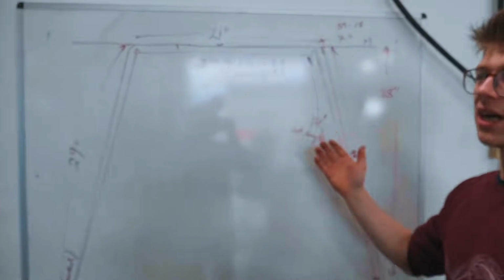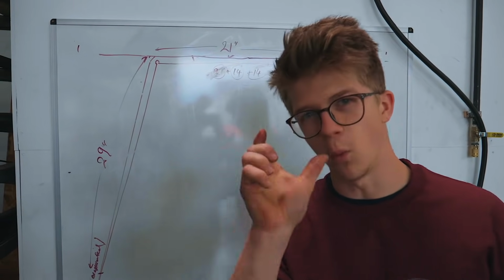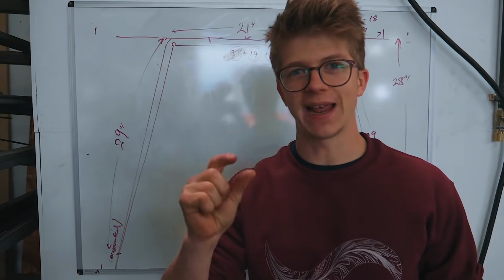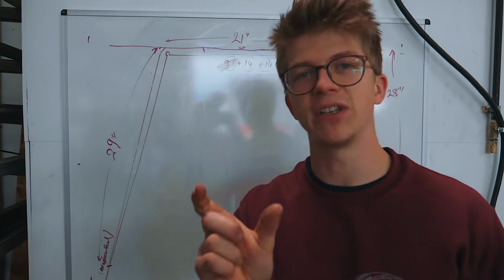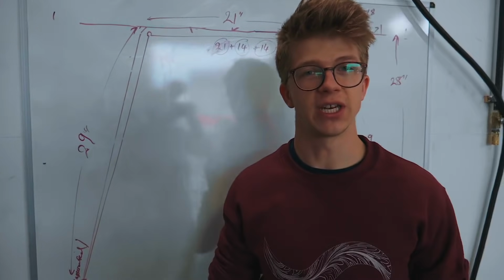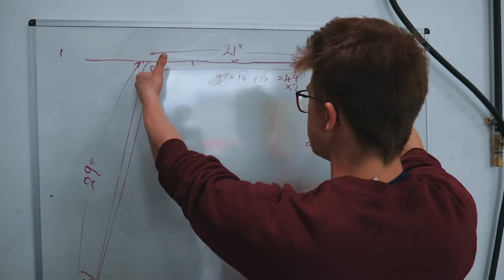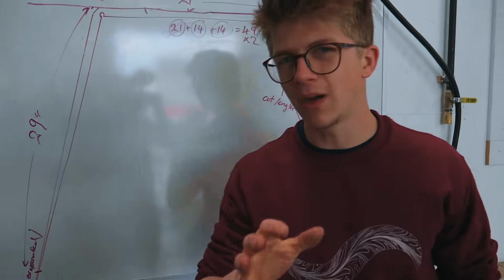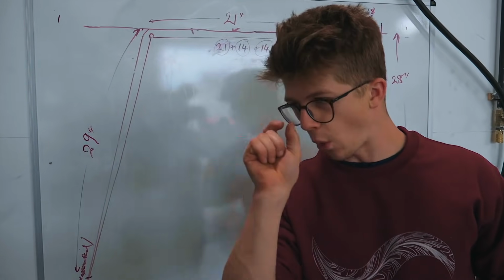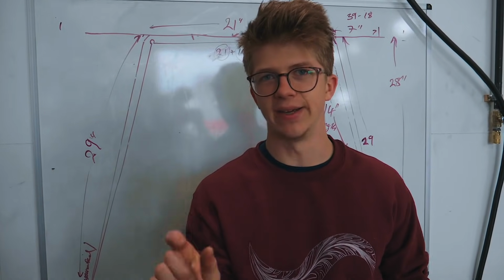We need to make ourselves a dining room table. Let's come have a look at what the plan is starting to look like. It didn't look like much from the end, but we're gonna be taking some chunky pieces of steel. We're gonna be taking a piece of 1 by 3 inch flat steel. That is 25 by 75 millimeter flat steel. And it is gonna be coming across the top of the table, and that's gonna be where it meets the tabletop itself. It's then gonna be tapering down into almost a hairpin style leg while leaving the ends thick enough to hopefully not damage the floor, provided we have some pads underneath the ends.